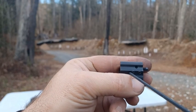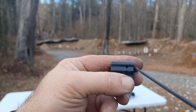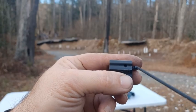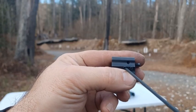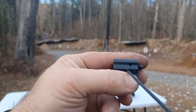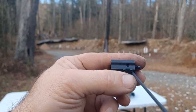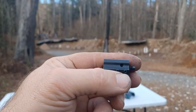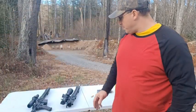The rear allen screw locks the gas valve screw in place so it can't fall out — even if you undo it completely, it won't fall out because that screw is holding it. It also presses on the indent behind the spring to lock it into the click positions.